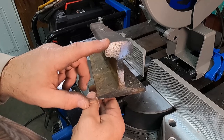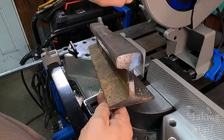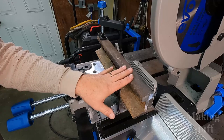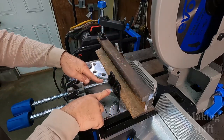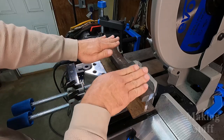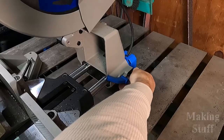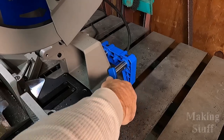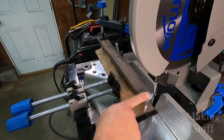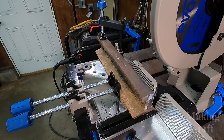No saw test would be complete on the Making Stuff channel without cutting a piece of railroad track, which is what I've got right here. I've put the mild steel blade back into the saw. I've got the railroad track clamped up — I did have to raise the bar and clamp the front clamps on the track, and I've also got the top clamp on. I did have to move the head of the saw forward a little bit using the slider on the back, which pushed the blade forward so it'll make a better cut on this railroad track.